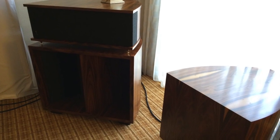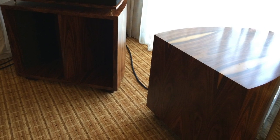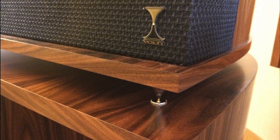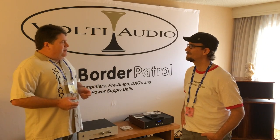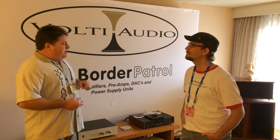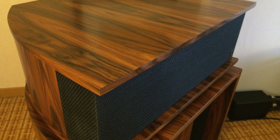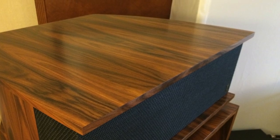This speaker takes us full range all the way down to about 50 Hz. Below 50 Hz, we have a subwoofer tucked over on the side, separately powered and crossed over at about 50 Hz — it just takes care of the last octave. These horn speakers give you everything you like about horns without the downsides. I'm a big tone guy, and they sing as one voice with a very smooth tone top to bottom — that was a major goal of mine.